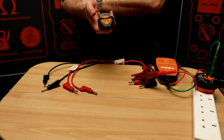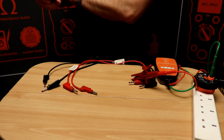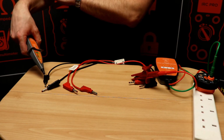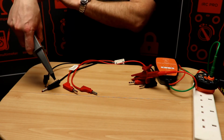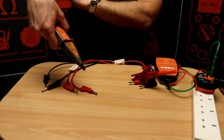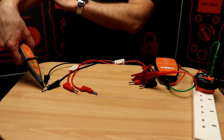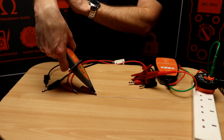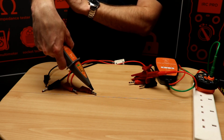I'll then use the DCF200 receiver and power that on. As soon as I approach a cable, I'll get a full signal. This works on a comparator, so I'll scan every cable that I'm going to pick. And then I'll do so for a second time. And it's obvious on the full scale deflection which is the cable that I'm connected to.